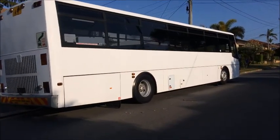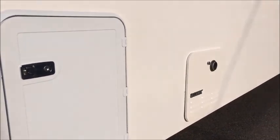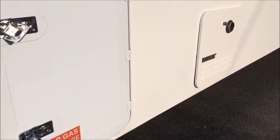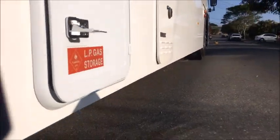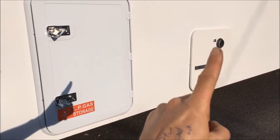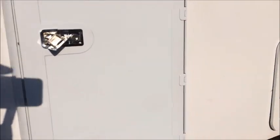Check this out — finally took me three days of planning, gluing, and painting. Finally got gas bottle certification all done and dusted. Had a bit of a mishap with the door — I bought a door that had air vents in the front, but because my hot water system is only 600mm away it's too close, so I had to change the setup to a solid door that's fully sealed with an air vent coming out the floor. That way it's 1.5 metres from that air vent to the inlet for the hot water system, which meets specifications.